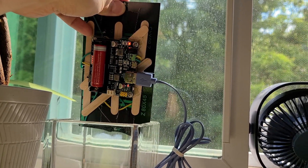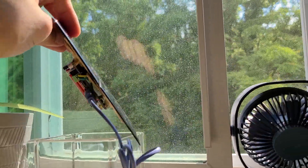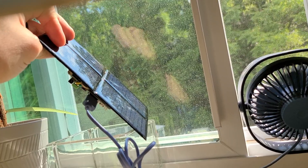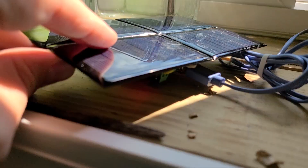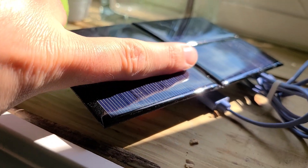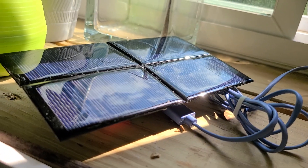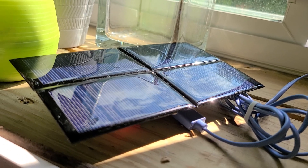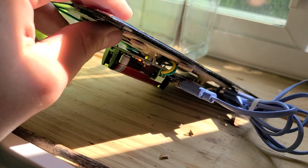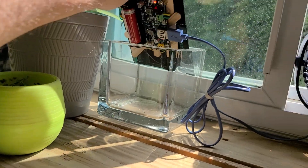The sun charges the battery, and I have these little solar panels — they came in a box of 30. They're really small output, just about the size of my finger. I think they're rated at 50 milliamps a piece, and I've got them in parallel-series to get the voltage I need.